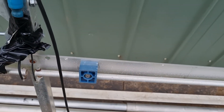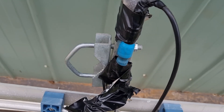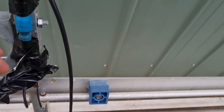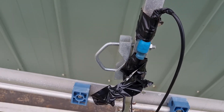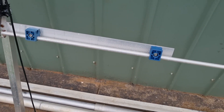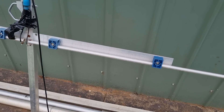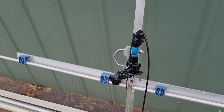Pop, as they call him, is from Serbia. To make the driven element plate I use a plate of flat bar that you can normally get from Bunnings. Doesn't cost a lot of money. The antenna brackets are available from Bunnings as well — you basically drill a hole through there. They're 50mm wide so you can use any long pole. Very, very simple design and construction. Doesn't take a lot of work — probably an afternoon would be enough. All the measurements are there; it doesn't have to be absolutely exact, but close enough is good enough.